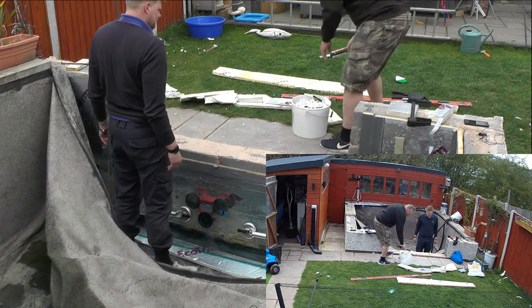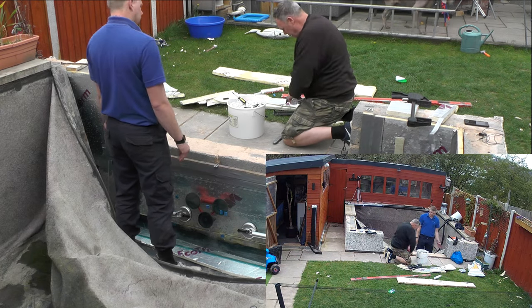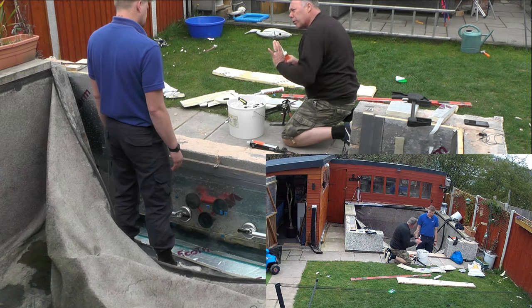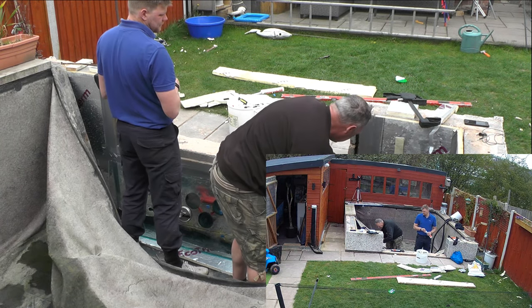We then got all the sealants ready and two grease guns, so that way we weren't wasting any time waiting to change the sealant tube, and giving the chance for the sealant to start skinning over. Just in case everyone needs to know, I use PU18 to seal the glass to the breeze block.